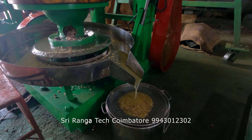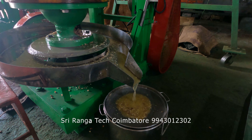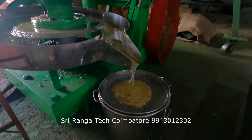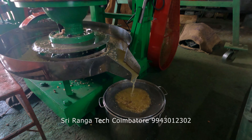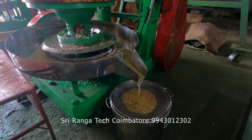We have some raw material, because when the oil comes out it will collect some raw material and come out with it. That's why we have a filter at the bottom. We collect all the raw material in this filter and put it back inside the machine. Whatever oil is collected will be stored in the vessel, and the filter will collect the raw material to be put back inside the machine for grinding.